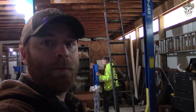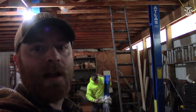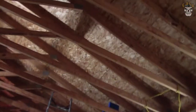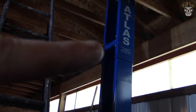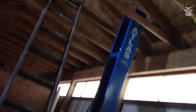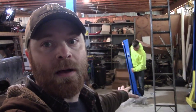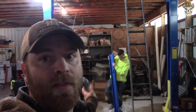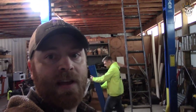Alright, next we got the two poles up and as you can see they are through the rafters. We already knew our ceilings aren't adequate for this hoist, but we're working with what we got. We're almost hitting the roof line right there. There are different stages — you can see three bolt holes — we have it on the lower one to clear. We'll be working a little low under this thing, but the next objective is the crossbars. We'll assemble those on the floor and then put them up to run the cabling through.